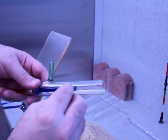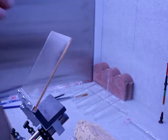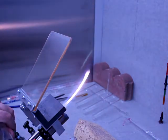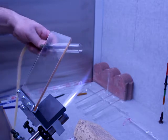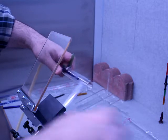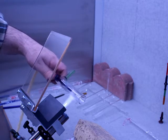And I'll probably shoot for about half an inch to 3/4 of an inch for the bottom of the bubbler from the stem in the inside. And right now I don't even have the blow hose in my mouth. I'm not going to worry about that till I pull this off. In this case, I could use that method where I've got the glass rod and all that stuff, but I'm just going to basically pull. This is a large enough section that I'm pulling off. Then I'm just going to do it with some tweezers.